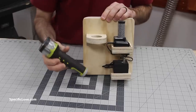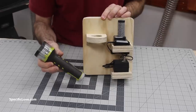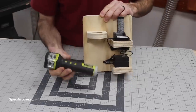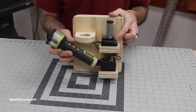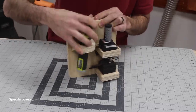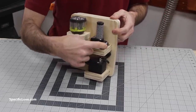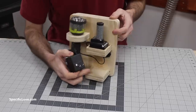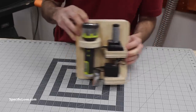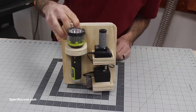When you're in your shop, it's always a good idea to have a spare flashlight in case the lights go out or you just need an extra light — but you don't want it sitting around where you can easily misplace it. So I created this nice little holder. This is the rechargeable version that comes with an extra battery and a charging system, so I created a holder for the flashlight using a Forstner bit. Over here are two little mini shelves — one with double-sided tape to hold the charger, and a second with lips so the plug doesn't slide off. That's a great way to move this around your shop wherever you need to.